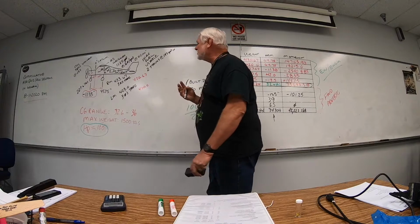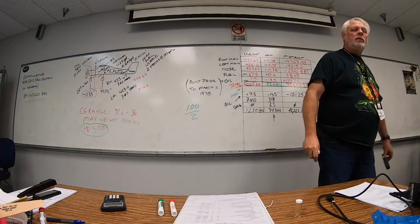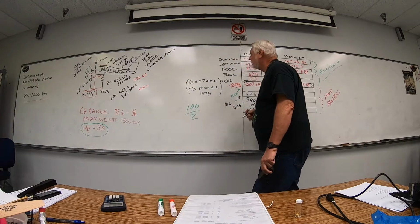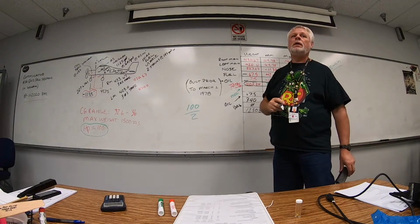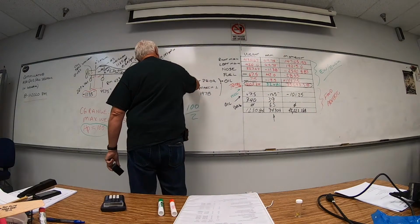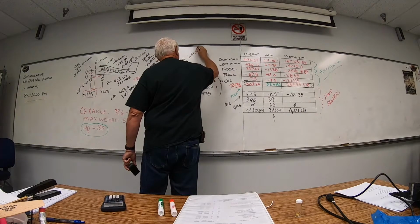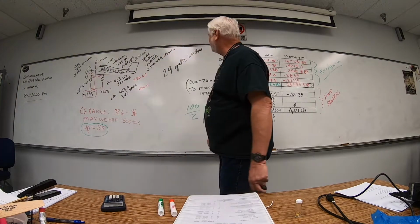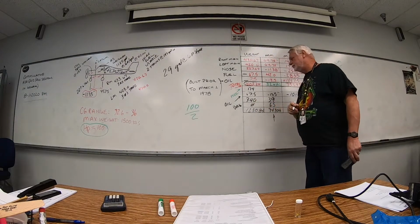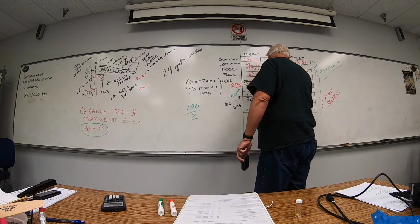On the type certificate data sheet, it told us how much usable fuel. For the 150, it was 14.5 gallons per tank. And we're at 6 pounds per gallon, right? Times 2, so there's what, 29 gallons at 6 pounds per gallon. So 29 times 6 will give us 174. 174 pounds. Don't know why I erased this. That did not change. That's at 42 inches.